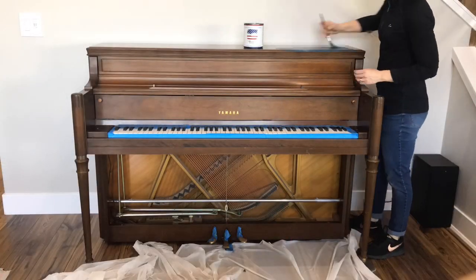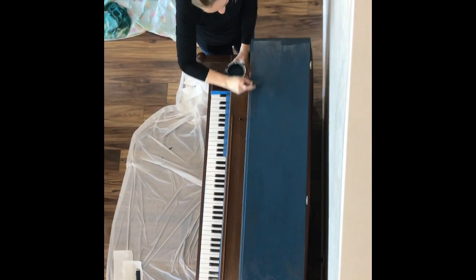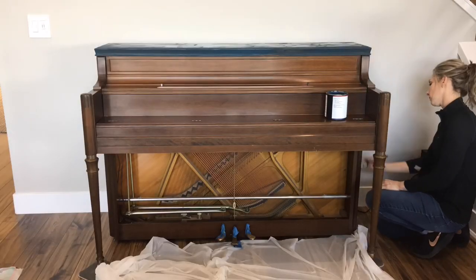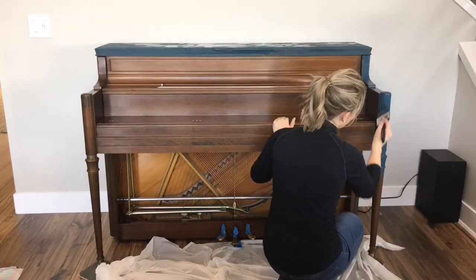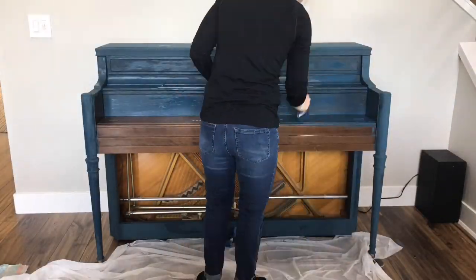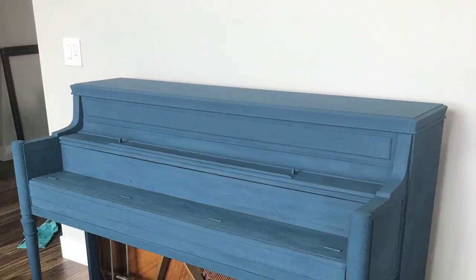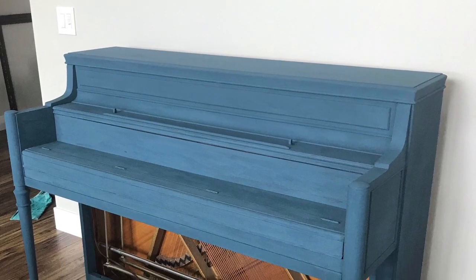I began painting a full-strength coat of paint on the entire piano and accessories. Depending on your room temperature, the chalk paint can dry surprisingly quick — in under half an hour. I then applied a second coat diluted with water for a smoother application, following the recommended dilution of one and a half cups of paint with one-third cup water, stirred well.